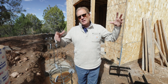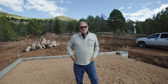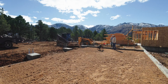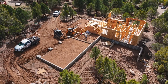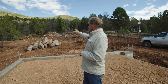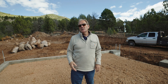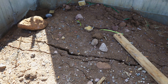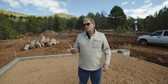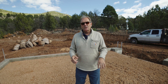Let's go up top and give you a bird's-eye view of what's going on and the logistics I'm working through for this entire job site. On some homes it's so tight, and eventually you can start to grade and move things out of the way — that's what we're doing over here. I brought some large boulders in from another client, and we're going to use those boulders to riprap down over here. This rainstorm has really helped to settle the ground — I saw a nice crack in the dirt, which means it settled probably a half inch to an inch, and that's helping with my grade issue.